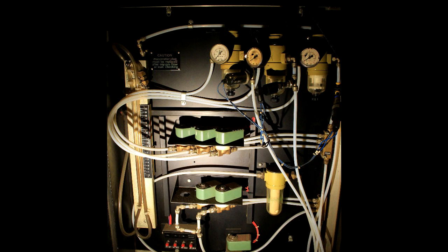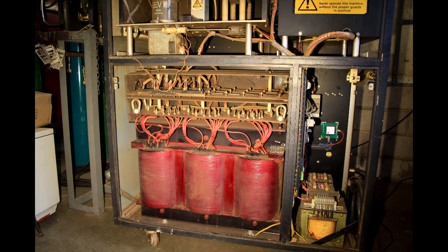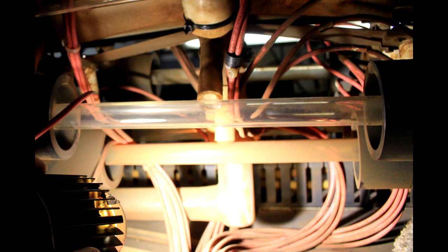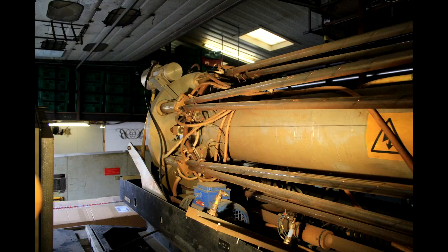These gases then go through a system which regenerates the CO2 and nitrogen, as some of that is converted to carbon monoxide and oxides of nitrogen. In the control box there are thermal regenerators which run at about 400–500 degrees to convert the gases back to CO2 and keep the mixture performing well. The power supply for this tube is about 28,000 volts at about 1 amp.